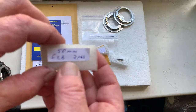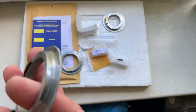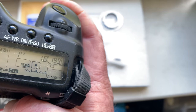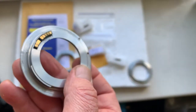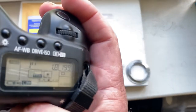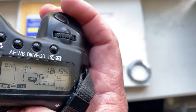Checking the two chips with data: 50 millimeter, aperture 1.8. Chip number two: focal length is 50 millimeter, aperture 1.8. Delay time to enter programmer mode is one second. Focus trap mode is on.